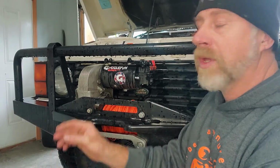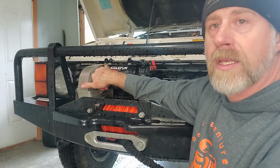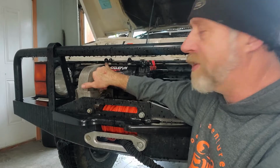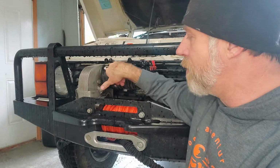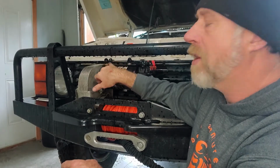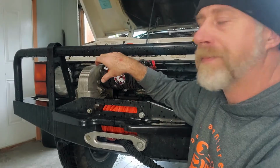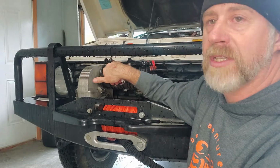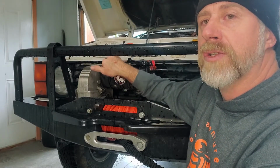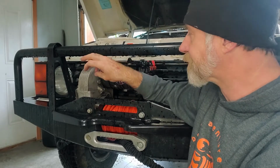What you want to do, take your 1/2 inch wrench, whether this is cables or you have the old style solenoid box on there, and get that stuff out of the way. Get your cables or your bus bars out of the way. Take them off of those lugs, so you'll have just 3 empty lugs.